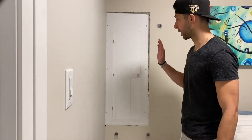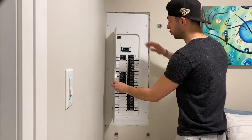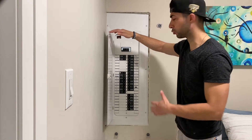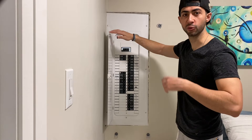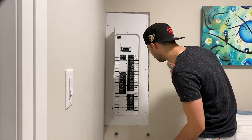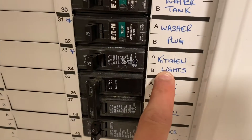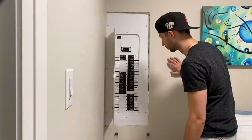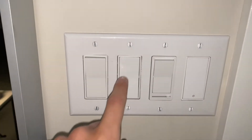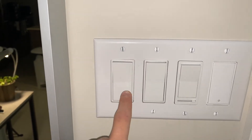Okay, first step: locate your fuse box. Your electrician should have labeled all the fuses by room and circuit type. I'm going to locate the kitchen label — here we go, right near 'kitchen light.' Switching that off turns off all my kitchen lights. A way to test that it's off is to just flip the light switches — if there's no action, you know the electricity is off.